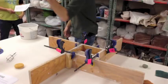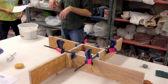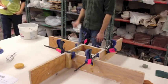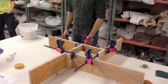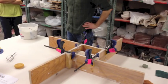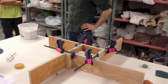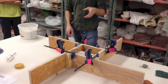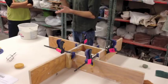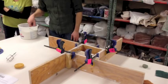It's a good idea to get a plaster container - you can use another bucket. Pour all your extra plaster in there and let it dry. It's better to have dry plaster set up and throw it away in the garbage than to have a bunch of plastery water. Also, it's probably a good idea to put it in a flexible bucket - if you put it in a five-gallon bucket it's really hard to get out. I usually keep yogurt containers around. And then you can carve things from a block of solid plaster - fill those yogurt containers up, it's like a blank. You can make a mold or reuse it. I have tons of blanks hanging around.